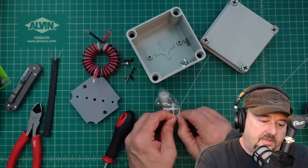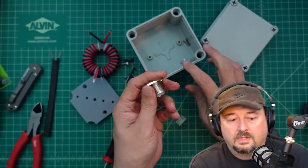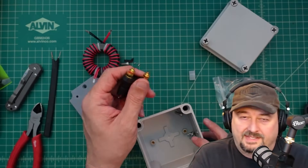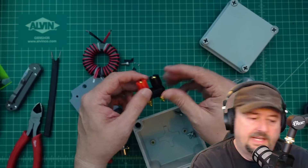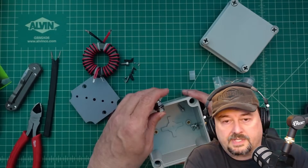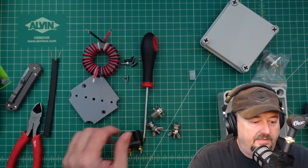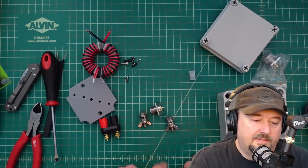For hardware, I think I'm going to use these SO-239s — just drill a hole and mount one to the bottom of the box. At the top I'll need connections for the shield side and the center conductor. I might use these 5-way binding posts, or I might just use these 1/4-20 bolt assemblies, one on either side. If you have a vote, let me know in the comments. I think I'm going with the 1/4-20 bolts — I think that's just going to be a better option for me.